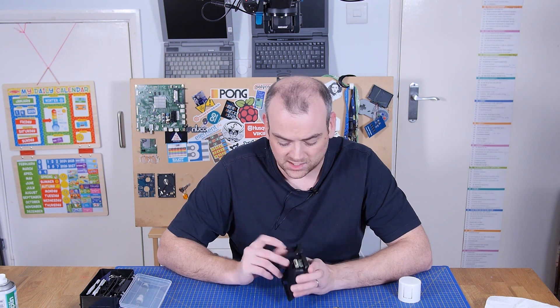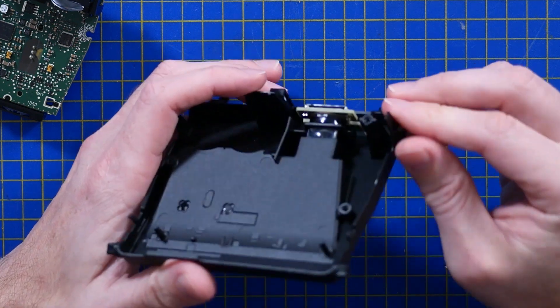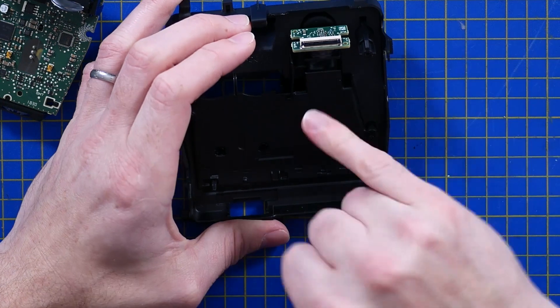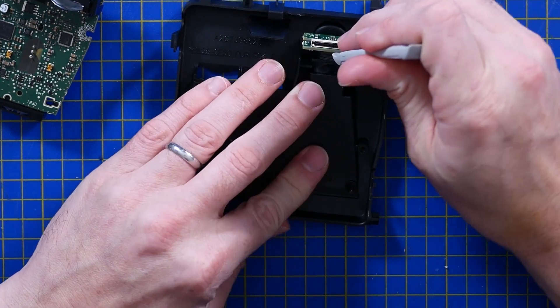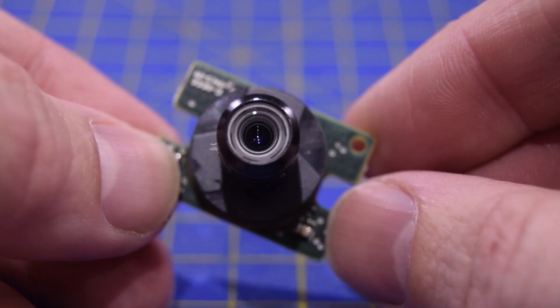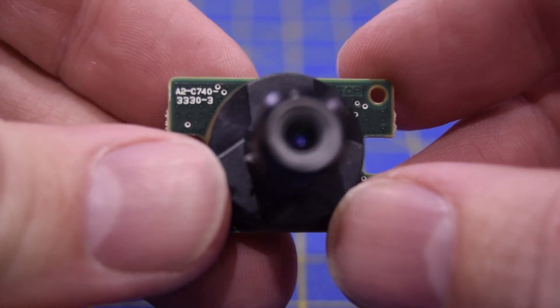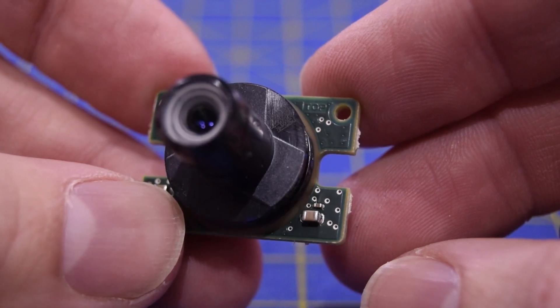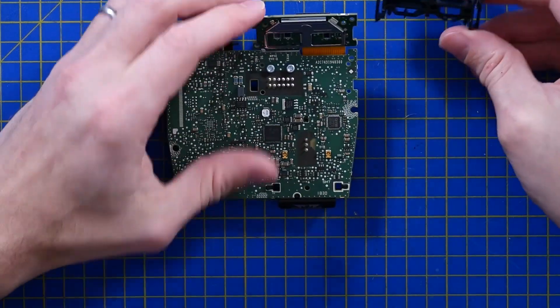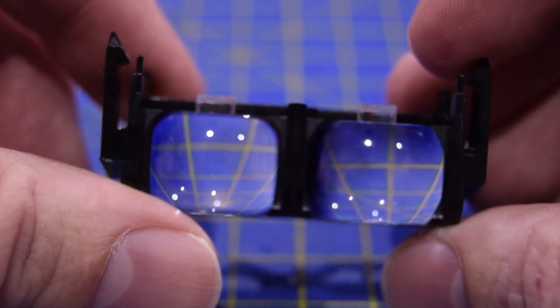This is a second-hand module responsible for safety in a car. I don't think after I've taken it apart anybody should use it, so I don't mind destroying it. What I'd like to do is get that camera away from its optics. This is very, very well glued - this potting material is not like a solid resin, it's almost like hot glue. There's the first optical camera module. Wow, there are three sensors there - I hadn't expected that. So these two lenses were covering three sensors. They're tiny little optical sensors.